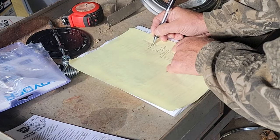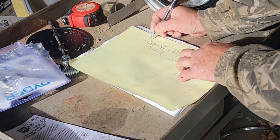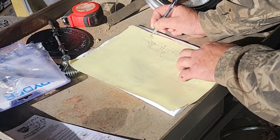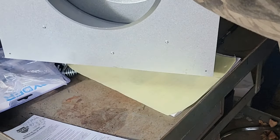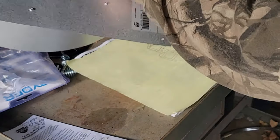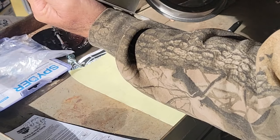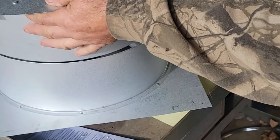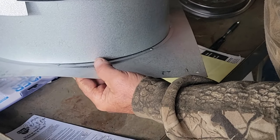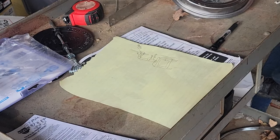This will be the outside, fit through the wall. Insulation can be around it — fiberglass insulation can be inside of it. Then this collar slides into it and matches up to the wall. The insulated pipe would slide through this, then I do high-temperature caulk on both sides — that way it's safe going through the wall. Once we get outside, it goes into the T. It'll have a support that comes back to the wall, two of them, to support this pipe. It'll have a band and a cap to enclose it for clean-out.